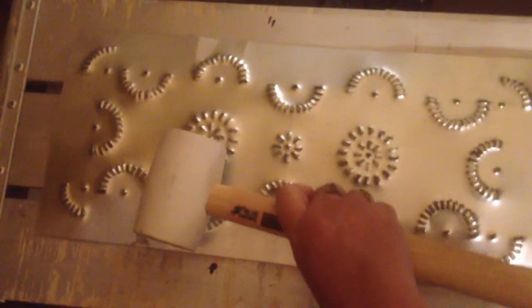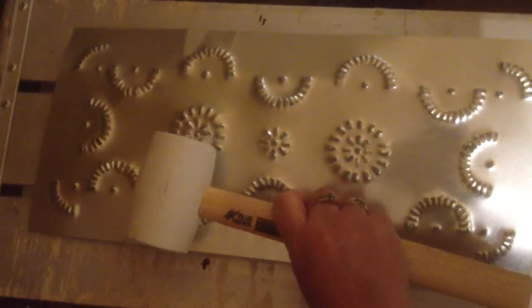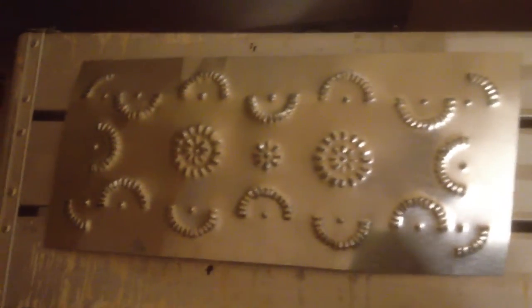Time for a new tool. After all that pounding, the metal can be fairly warped. To remedy that, flip the sheet over and, using either a rubber or rawhide mallet, pound the edges back down. Because those sharp edges on the backside could cause problems later, use your hammer to dull those too.